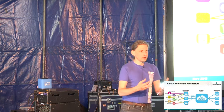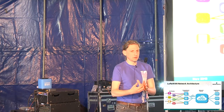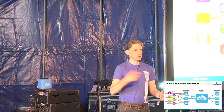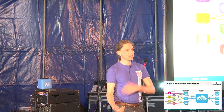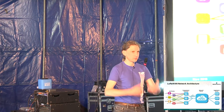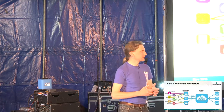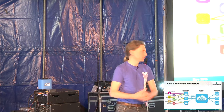So if somebody picks up your signal and can capture it, they can't send exactly the same thing again. I don't recommend it for unlocking doors, but say you used it for unlocking a door, they could capture that, send the same thing, and unlock the door. You wouldn't want that, so it has a counter which counts up every time. And it's really annoying if you reset it, because you've then got to go into the system and the counter's going to be 0 again or something.